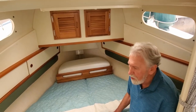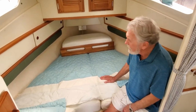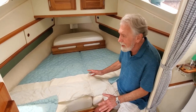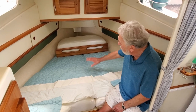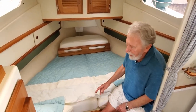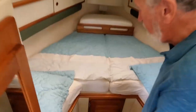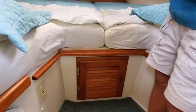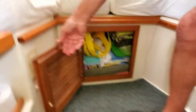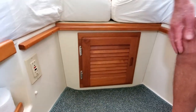We made a number of modifications to the v-berth area. The traditional Rossboro cushion arrangement had solid boards on the bottom that made them heavy and awkward, so I took them out and put in two standard triangular v-berth cushions — five-inch cushions plus two inches of memory foam, extremely comfortable. There's an insert that goes into the middle area when making it up into a bed. I also blocked off the area that Rossboros traditionally leave open and added more storage in there for towels, bags, and things like that. Formica makes it match the rest of the boat.